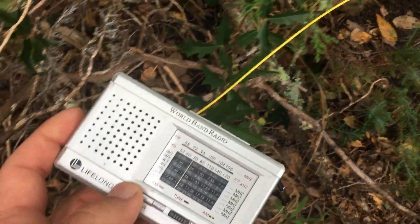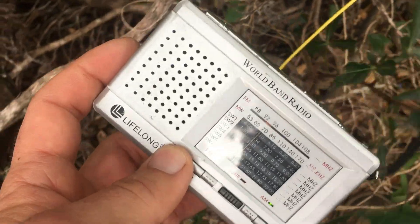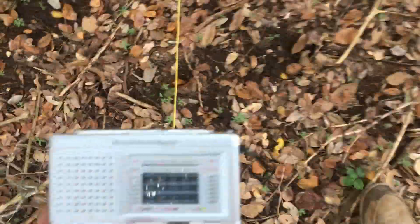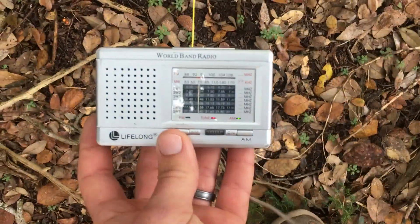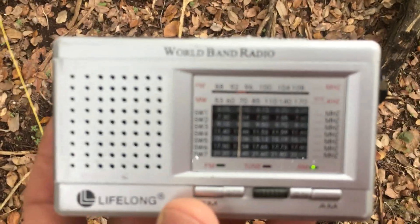We found the break. You can hear how weak the signal is here. I just followed along until I found it. Just 10 feet away you get a good strong signal up about 3 feet above it. So you can tell the difference in the signal strength. Just follow it along until you find a weak signal — the weaker it gets, the closer you are to the break. That's it.